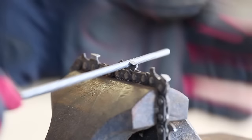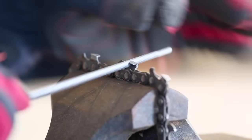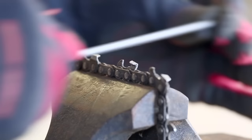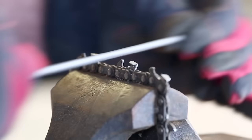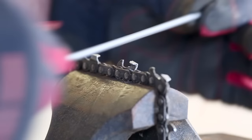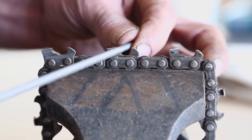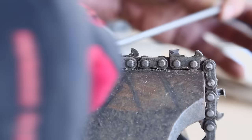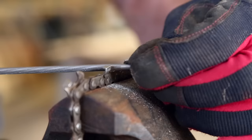These teeth on this chain are very cornery teeth — they're called chisel teeth — and you've got to file it away until the damage is visually off the front of the tooth, or the approaching edge. Be very careful about the depth and about the stroke so that it comes out just right. The stroke is important for other reasons too: if you let the file do this, it actually chips the teeth off the file and the file doesn't last anywhere near as long. So controlling the file is very important. Don't rotate the file as you file — it just complicates matters too much. Make almost every stroke with the file in the same rotation, and if you want to change the rotation later, just tap it a little bit to knock the stuff out of the file and then continue.